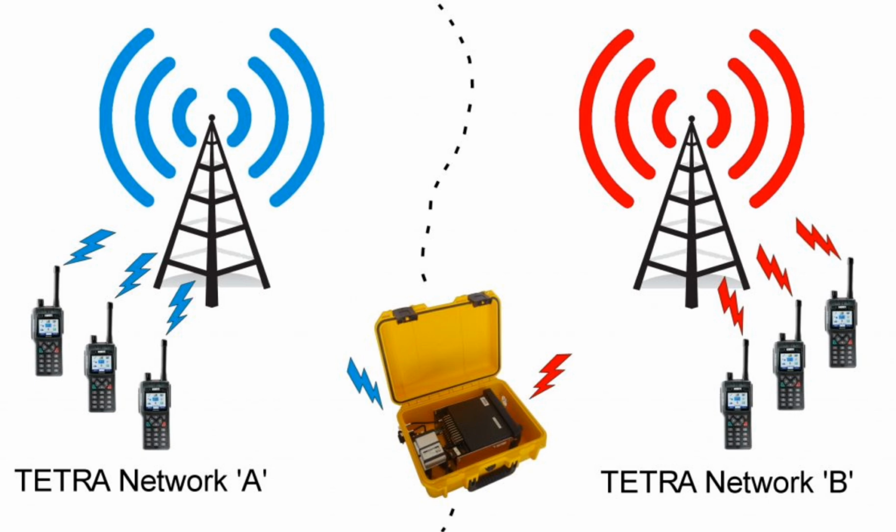And the radio performance itself? Key things there are the duplex spacing, the bandwidth, channel spacing, all standardized. Transmit power is adjustable, goes up to 10 watts, which is quite strong, but can be turned down as low as 0.6 watts. And that RF filter module has to meet strict ETSI standards, European regulations. On the receiving end, it's got high sensitivity, meaning it can pick up weak signals and good interference rejection. Plus dual diversity reception, which helps combat fading.